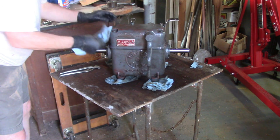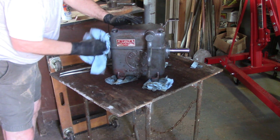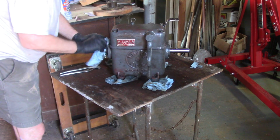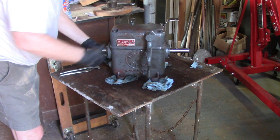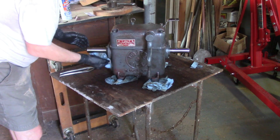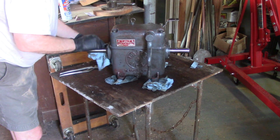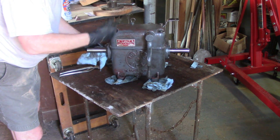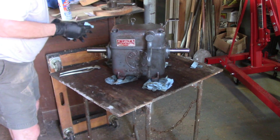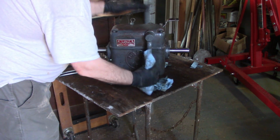When I picked this up, this came with a lathe. It's the speed reducer from the 1725 RPM electric motor to the 300 RPM of the line shaft, I believe. Anyway, this one came with a motor. It's its transmission. Came with a lathe. I picked up another one. I don't need it. I have another tool.